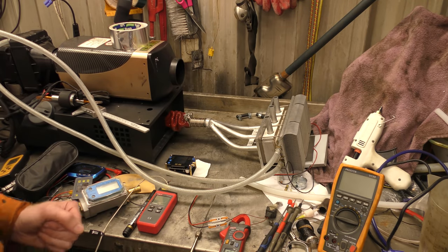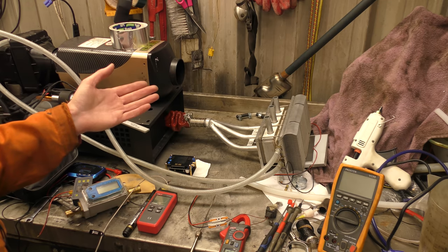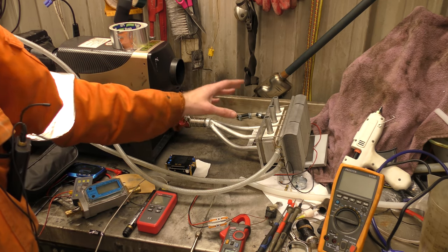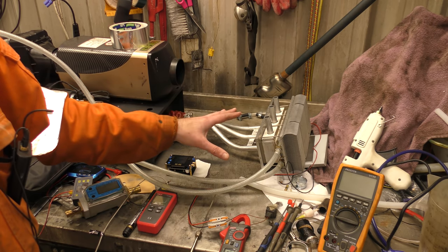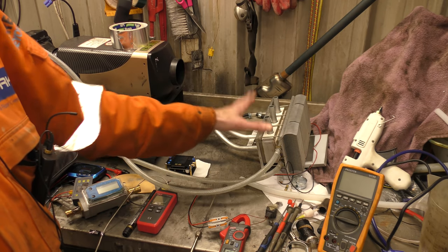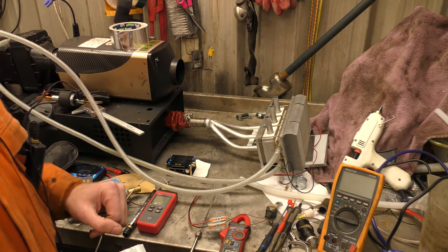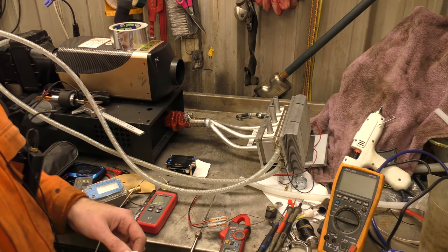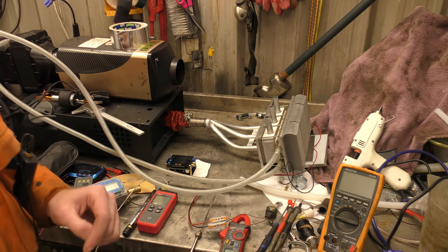Well, what have we learned? We've learned that £300 worth of TEGs and probably an ungodly number of man-hours to make this beautiful setup gets 1.5 watts out of it at 6 volts in usable power. That's a hell of an expensive way to do things.